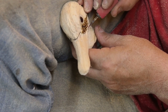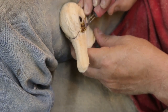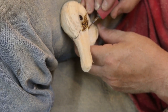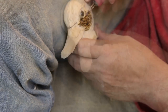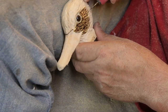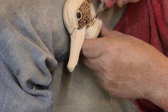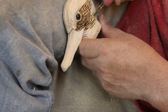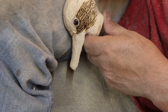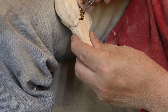This is not even close to the final process - I'll take some diamond bits, stones in various different shapes over this. When you hear a decorative decoy is 'stoned and then burned' or 'burned and then stoned,' what they're talking about is taking little ceramic stones or a diamond stone and cutting feather shapes, then coming back and burning more detail into it, doing that back and forth two or three times. This is sped up four times faster and again I'm just kind of getting a direction here - you'll see later that the direction of those changes a little bit as it gets more defined.